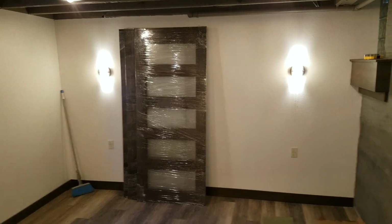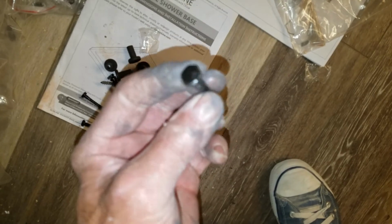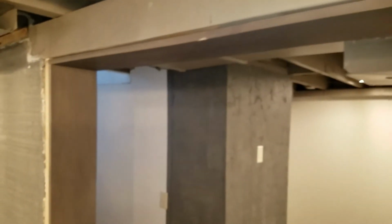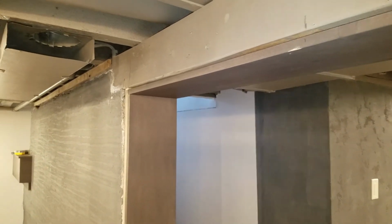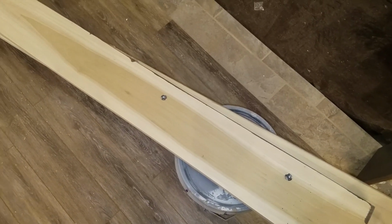Now, because our barn doors are going up against a cement wall that we cut out, you can't get bolts in unless you want to use silly lags. We just put T-nuts on the back side and we'll bolt it through and just use 2 inch by 1/4, so it'll just go up against the block there. We'll nail into all that up against the floor there. That's the best we can do. So anyways, that's how we're doing our barn door in this little house.